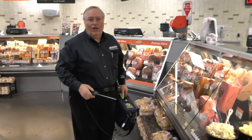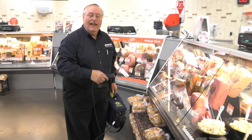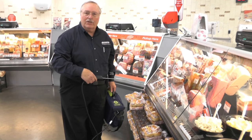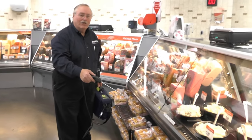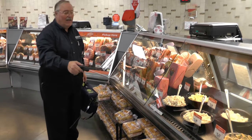If you find any leak at all, it's best to go a couple of feet at a time and you can watch the PPM value increase as you get closer to the leak. Any hits, I start looking in very close detail a couple of feet at a time.